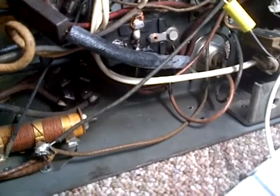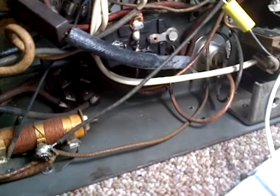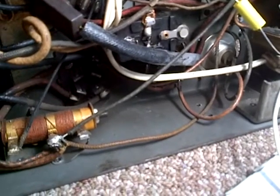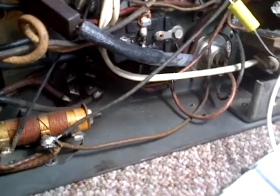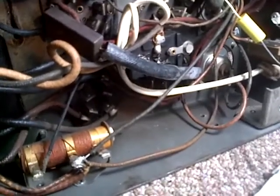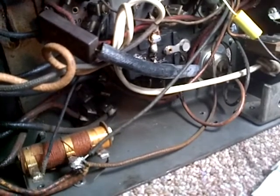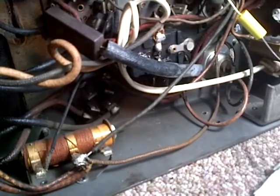It's set up in a way that as soon as I plug this radio in, those capacitors are energized, and they always are as long as the radio is plugged in. It's only 120 volts, but that's a lot of service time. And secondly, if they do fail, they're contained in that block. If you get a power fault to that block, and if the fuse on your house circuit is slow for some reason, maybe an arcing fault, not quite enough current, it wouldn't take long to turn that into quite a conflagration and maybe even a little explosion.